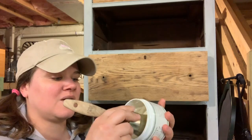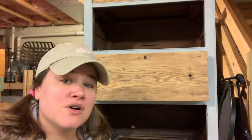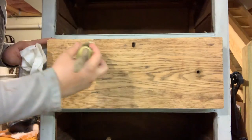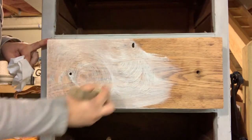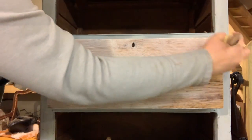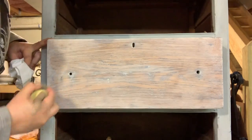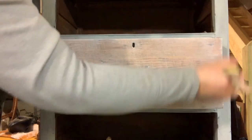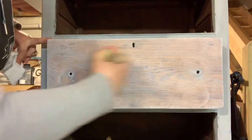I'm gonna get a little bit on my wax brush. For this technique you want to use a little more white wax than you normally would if you were gonna put it over milk paint, just because we're trying to cover a raw wood surface. You're gonna need a little more than usual. We're just gonna smush it on. You can go in all different directions — you can do swirls, up and down, left to right. I encourage you to go in every direction because especially over oak there are so many little places in the wood grain that this wax can get nestled into. The more directions you take your wax, the more places there are for it to settle into.